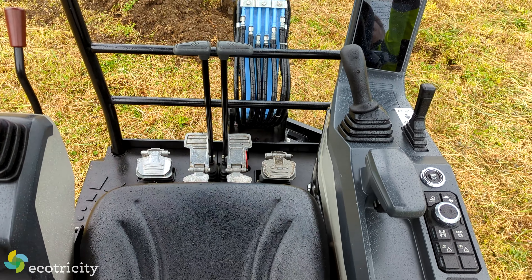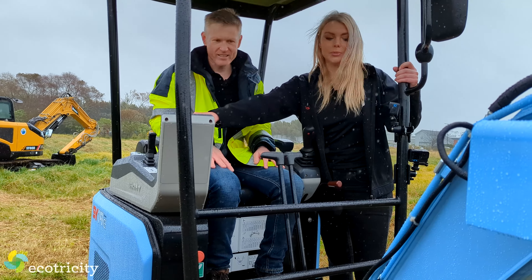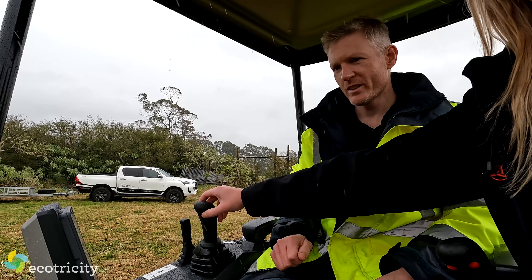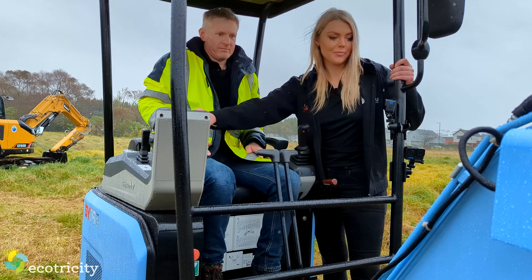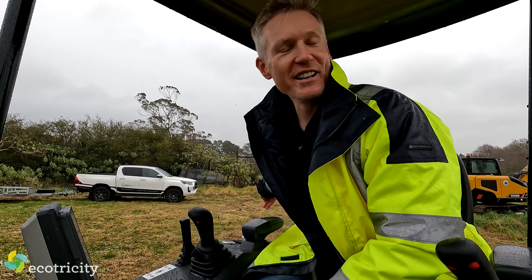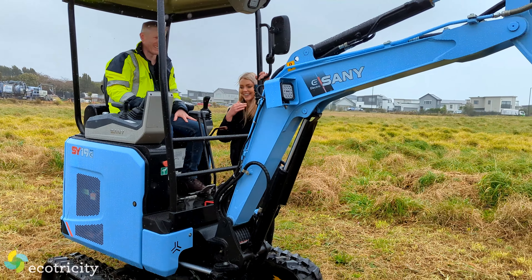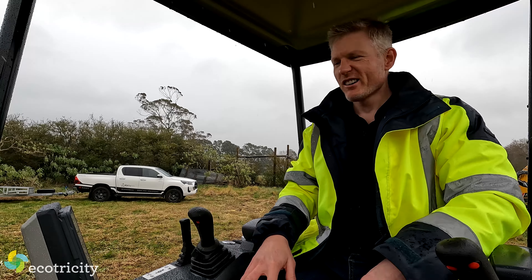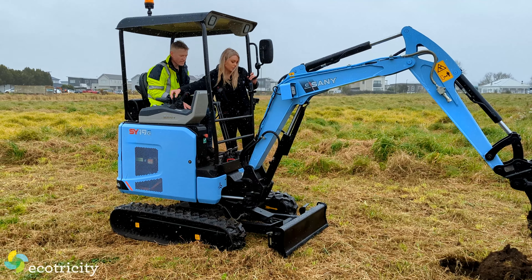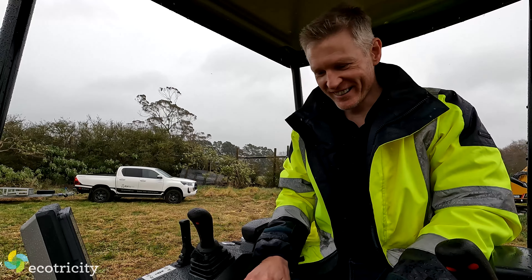Okay, so there's more pedals than I have feet. What do I do? Just ignore the pedals from now on. We want to press this down. Basic operation: this is lift the boom. Left is putting the bucket up, right is down. So basic operation, we want to go down like this. There we go. I'd like to, if I can, without hitting any of the cars around us, go over there and dig that hole. Very easy — up is accelerate, back is reverse. Now Brad's backing off, that's a smart thing to do. So we want to track this way. Just give it a go, give it a practice. I'll figure it out. You always want to make sure your blade's up — so this is the blade. You can use the blade to bring your bucket up, to eat dirt into your bucket. I could do this. Multiple things. This is fun, let's give it a go. Everyone stand clear.